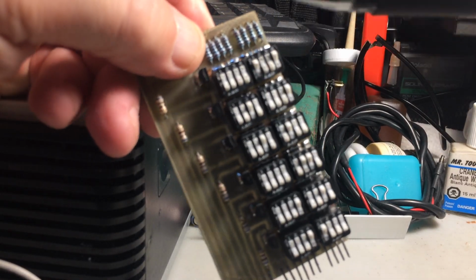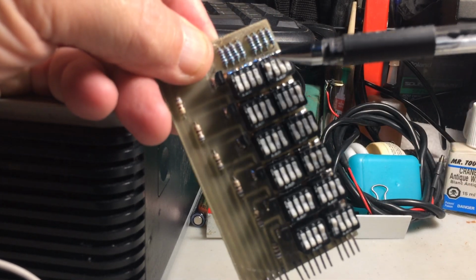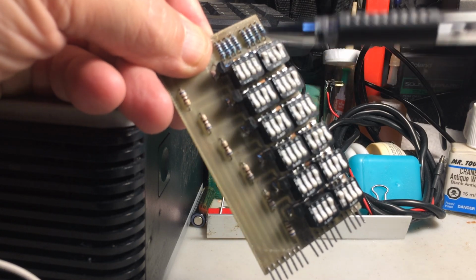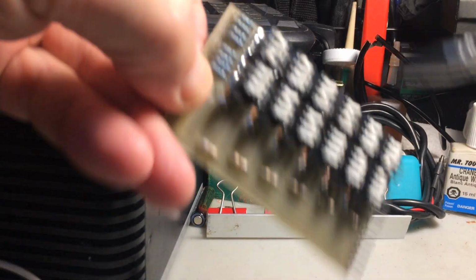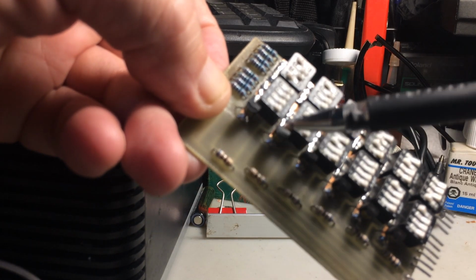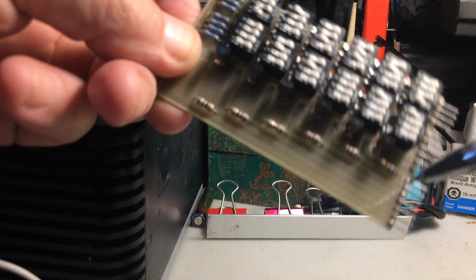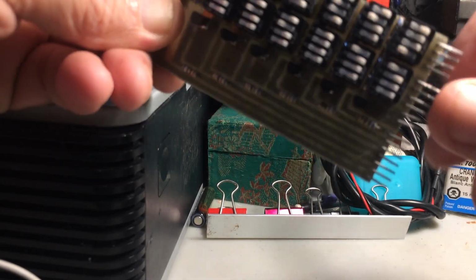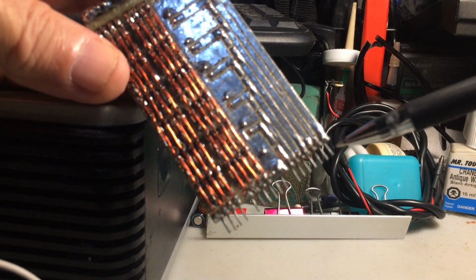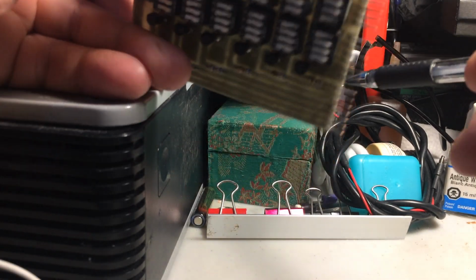And then by selecting the dip switches, what you're doing is setting up the output lines for that sequence of binary data every time that line gets triggered. And these rows in this direction are triggered by which transistors are activated, and the activation of each transistor is controlled by these lines down here, because you can see that from the back these control lines actually go up to each individual transistor through the resistor, the base.